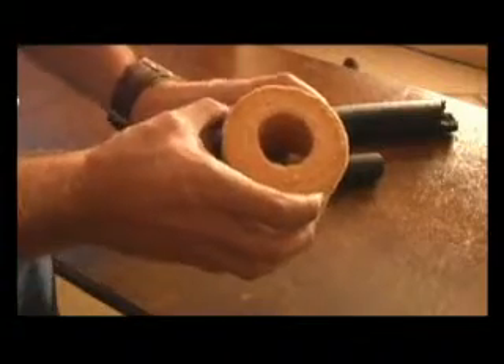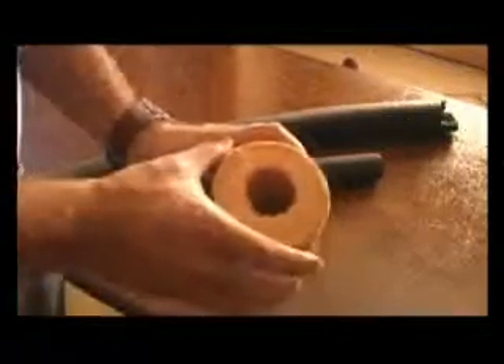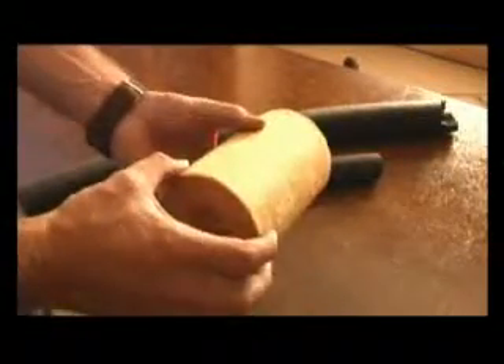This is a thermal insulation, which is a glass wool type material — fibreglass. It's normally used in steam plants in factories. It is water absorbent, so it needs to have a casing over the top of it.